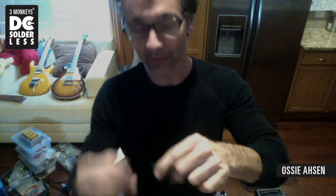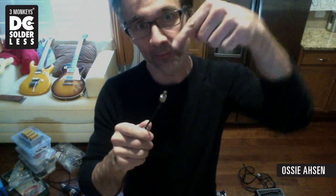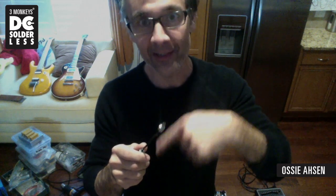I just screwed this side in. I've already had a piece of pre-cut cable here. I'm screwing it in the other side over here as well. What happens when you're screwing this in is those threads cut the insulator — we designed this cable specifically for this purpose. The insulator is able to be cut by the threads, the threads make contact with the shield, and as the wire is forced down into the unit, the center conductor makes contact with a pin located at the bottom of the threaded insert.